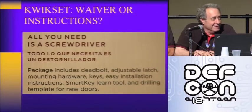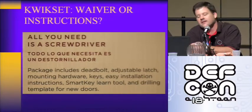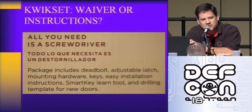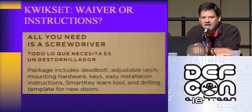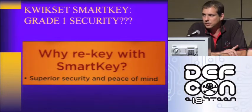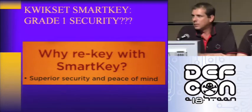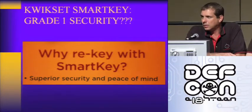It's important to note: this is a destructive entry. In this scenario, leveraging the screwdriver, the blank — a normal KW1 blank inserted into the lock — torquing it, opening, and ultimately relocking the lock is destructive. There are tools on the market that allow you to remove the need for that blank, and actually a valid key will still work with the production tool. You won't be able to do this with a regular pin tumbler lock. Kwikset told Wired they'd have to see the video. Customer service has told us they're aware of the tools for several months and investigating. We just did it with simple tools rather than a $90 locksmith tool. We go back to the basics: how much tool time and training you need to open this lock.